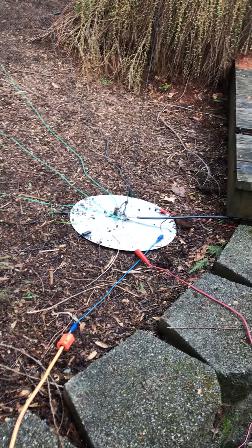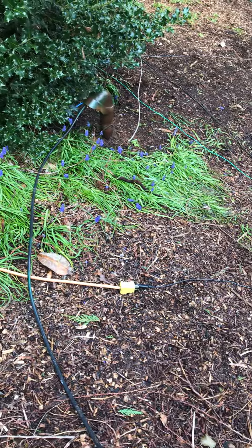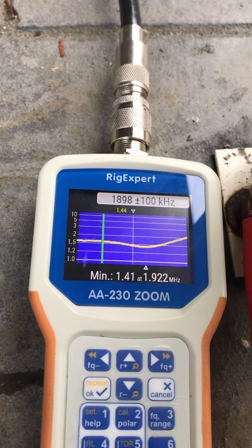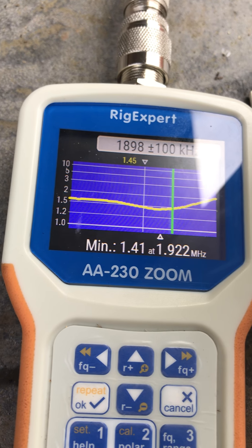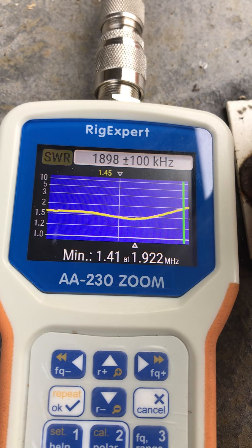So I have some ground radials, some extension cords connected with clip leads, and so on. But this one that grounds to the awning — if I put it on this rusty bolt, I want to show everybody what the curve looks like. We'll do a scan with the RigExpert here. It flattens it out, which is really nice. It was never this broadband before. 1.5 to 1 pretty much across the whole 160 meter band — starts to go up toward the end.